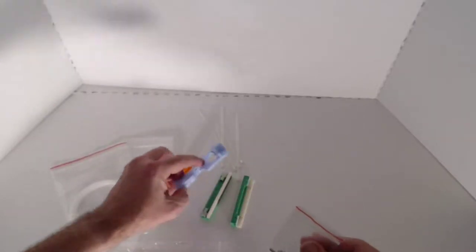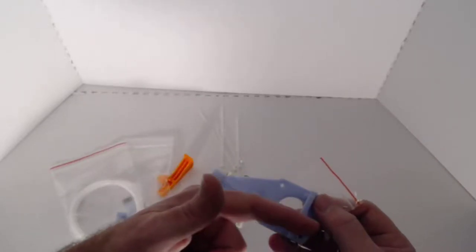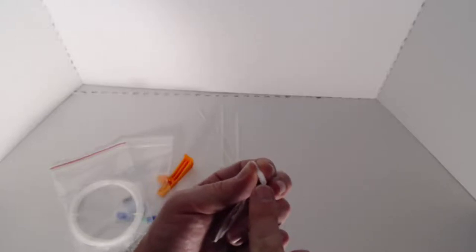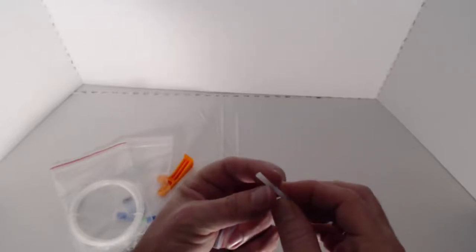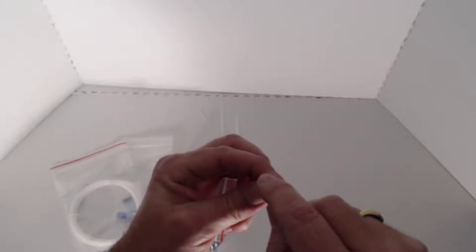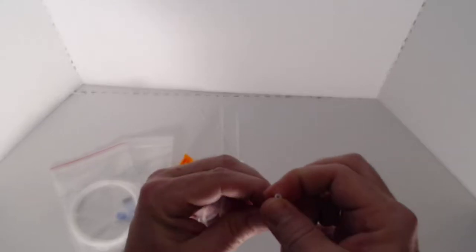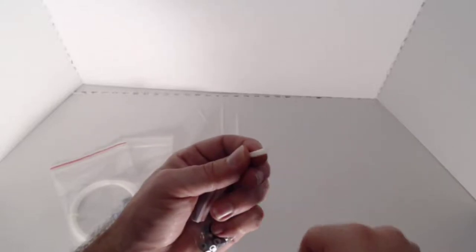So we don't want it to get jammed, specifically coming into here, for example. If it comes into here and it can't make it straight into here, it's going to cause a problem. So this PTFE tube is a special piece with a 1.8 millimeter inner diameter, to constrict that. Now, we've also modified it slightly in that the input end of it is larger. It's about 2.25 millimeters on one end and 1.8 millimeters on the other. So you want to be very careful when you're inserting this. The larger opening goes at the top, and the smaller opening is going to be at the bottom.